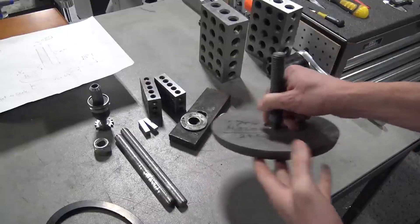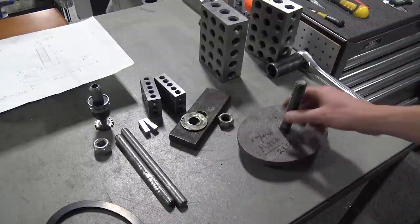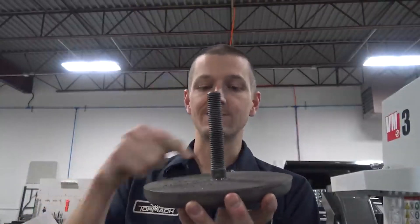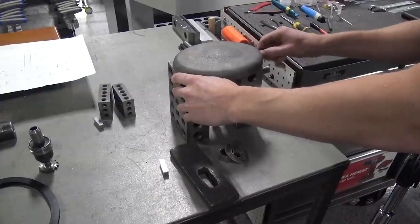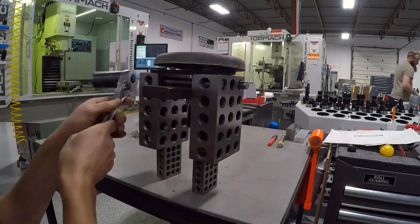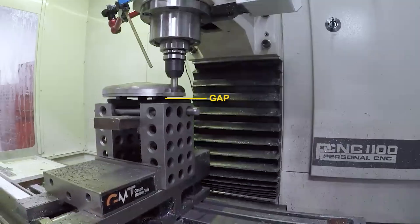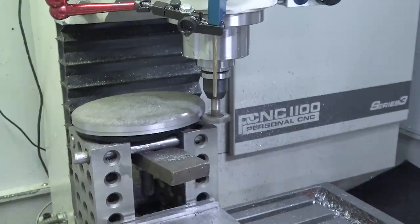Continuing with 246 blocks — we did a part in collaboration with Keith Rucker where he sent us a casting. The problem was how to hold onto it. There was a piece of threaded rod as part of the casting, but it was at a nasty angle relative to the part. We used a pair of 246 blocks, slid steel pieces through them as a backstop, spanned a bar across them, threaded a nut onto the all-thread that was part of the casting, and held that whole assembly in a vise. This also let us intentionally space the part slightly above the top of the 246 blocks, which allowed us to use a Woodruff key to provide an undercut relief — doing the whole job in one setup instead of two.